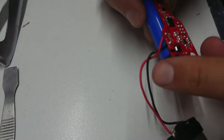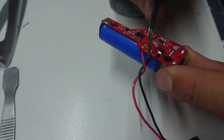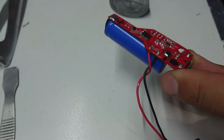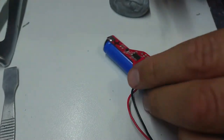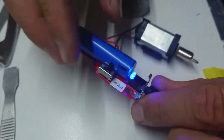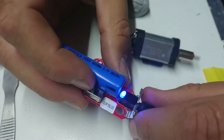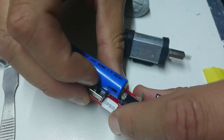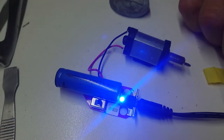Taking a moment to examine things before I plug anything in. I did briefly short circuit things before - that was between this pad here and this corner here, which was just creating ground to the battery. It looks like it's a common positive to the battery and they're regulating or doing the pulse width modulation on the ground. So I think maybe we've upset the battery circuit - we're going to give it a kick start. We have a pretty blue light which is nice. We can get the motor going on the charger but it's really slow. The switch is a little bit dicky. Now we've got motor moving - we are running off the battery now, and it will turn on and off using the battery.